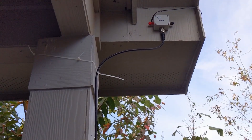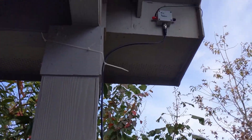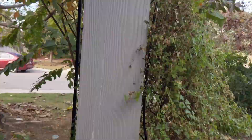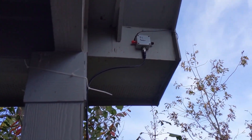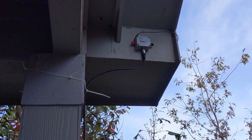The only issue with this kind of antenna — well, there are a couple — but you have to make sure that you have a 1-to-1 current choke on your coax, because your coax will act kind of like the other end of a dipole in this instance. You might get some RF in the shack if you don't put a 1-to-1 current balun in.